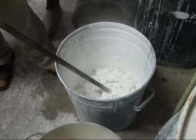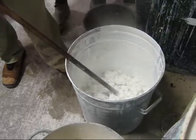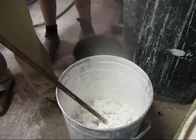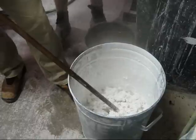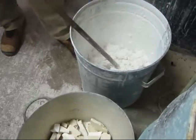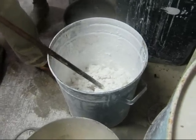If you had a dirty stone wall, you'd take that hot mix and with a stick plaster it onto the wall. The heat activates the minerals in the wall and pulls them out into the lime. Then you pull the lime off afterwards and it pulls the dirt out of the wall. But it's extremely corrosive and it's hot, so there are health and safety issues. In the end, just use soap and water — stuff that doesn't hurt your skin and it's not going to hurt the stone either.